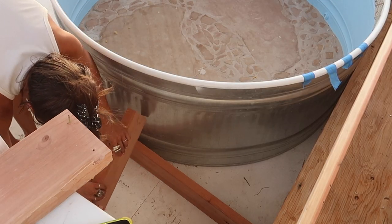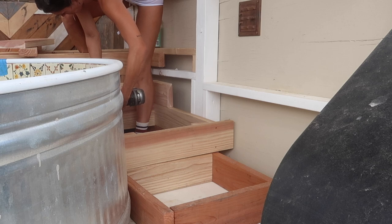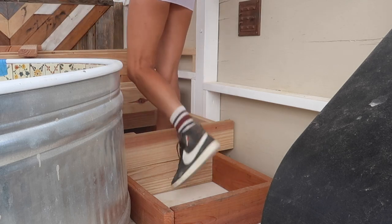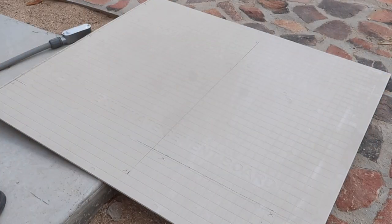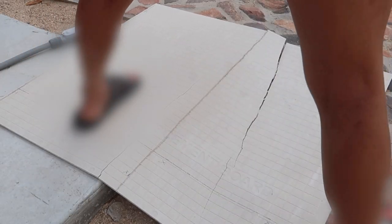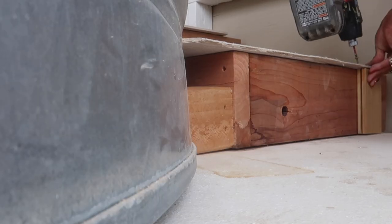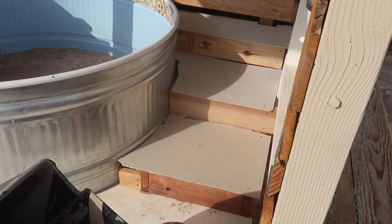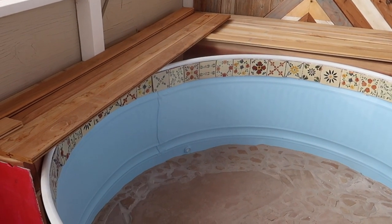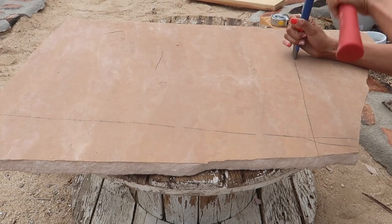Having the wraparound just on the back left corner seemed a bit odd for the design, so I framed out some quick stairs from two-by-sixes I had on hand and stacked them on top of each other. I cut out some hardy backer to be the top of the steps because I want to do full flagstone pieces for each step leading up — I think having a break in the Ipe decking would be a nice natural element. We red-guarded the hardy backer since we're placing stone, and then started placing the Ipe decking above to wrap around, and I just got very very excited.